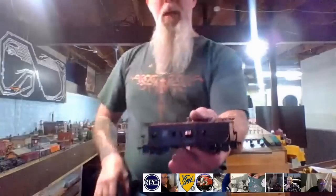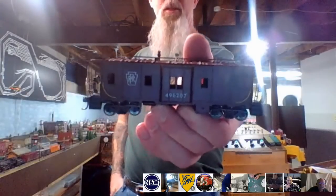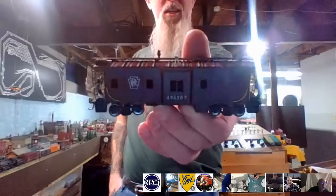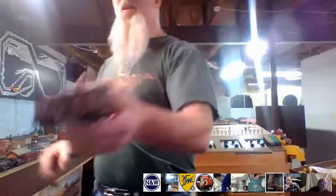Where the question about AC versus DC really comes in is, what does the motor inside the locomotive get between the decoder and the motor? That's a whole separate system. That's not sending a digital signal. It's an analog voltage signal. But what they found, the very first decoders 25 years ago gave it variable DC.